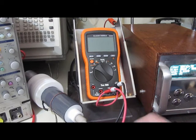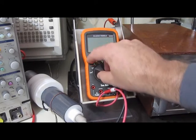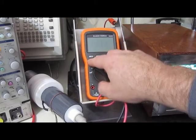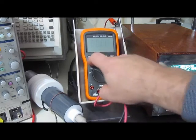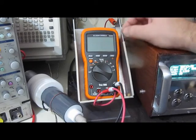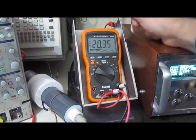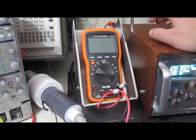When it resets like this, it makes it very difficult to test the meter — I can't really run this through all the modes. You can see it's like the display is doing something. It's definitely not all the way shut down. The only way you can reset it is turn the thing off and back on again. I don't know why negative transients seem to upset it more too.